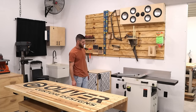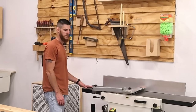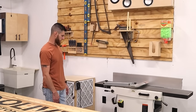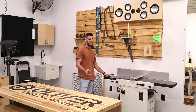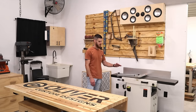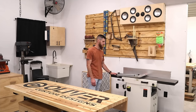This is the Jet 12-inch jointer planer combo. I love having the ability to joint 12 inches. I wish the planer size was a little bigger, but it's a sacrifice I was willing to make to have that capacity for a jointer. I've had no problems with this. It did take a little while to get the beds coplanar — that may have been because it was my first time messing with a jointer, or because some people have said this particular model is hard to get coplanar. So it took me about two hours to get it dialed in, plus I'm a little OCD, so I was getting it to within a thousandth of an inch.